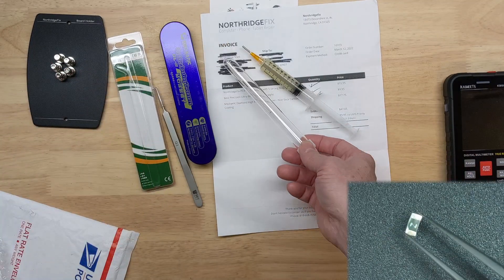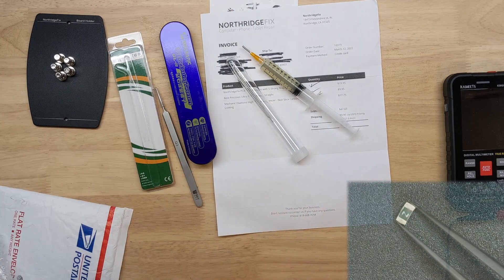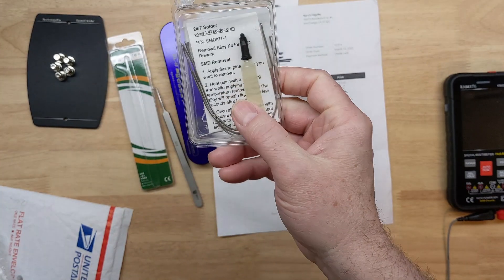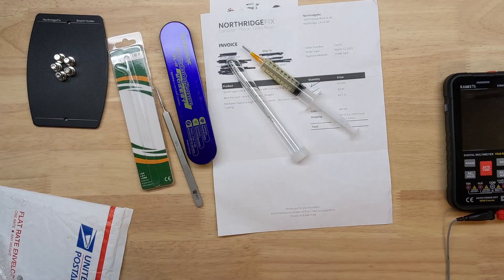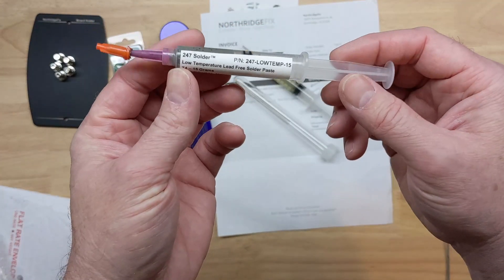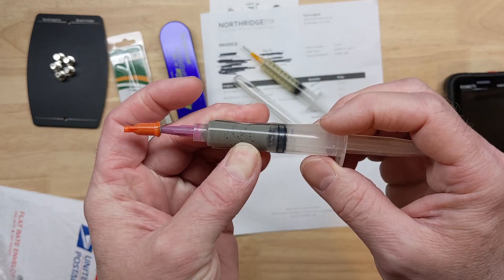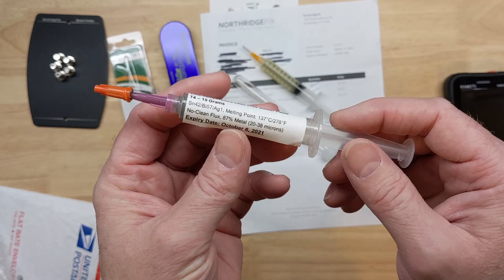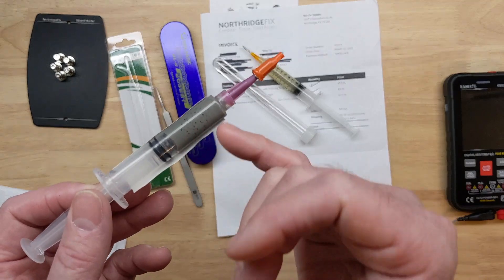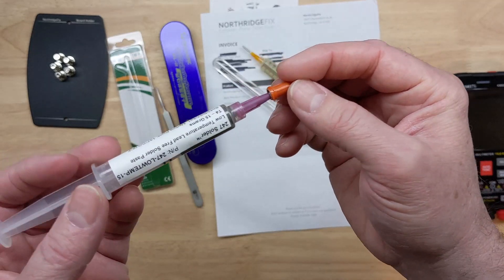It helps remove especially larger components very easily at a lot lower heat. Sometimes I get the alloy kits for SMD solder work from Amazon or other places, but I really do like the low melt solder that they sell. I used to use lower temperature solder paste, but the paste goes bad on you pretty quickly if you don't use it, so I do like the low melt solder a lot better. You gotta be careful this stuff doesn't get away from you — I usually keep it real pinpoint and don't let it get all over the board or you'll have a big mess.